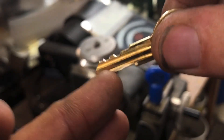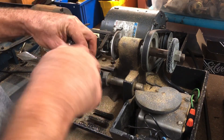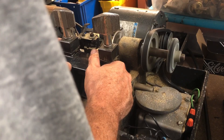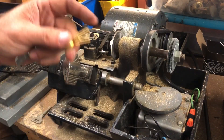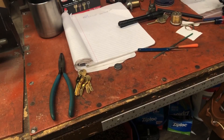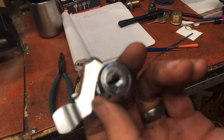So that is it - three, one, and there is no cut in the front. I was guessing right: three, one, three, two. Now I'm going to turn this around to the duplicator and duplicate it real quick. I did not brush it yet - Kim pointed that out to me the other day when I was cutting a bunch of keys. She said 'you didn't brush them' - that's one of those rules where I told you to always brush keys before you copy them, but do as I say and don't do as I do. Now that we have them both done, let's brush it and give it a try - make sure both keys work.